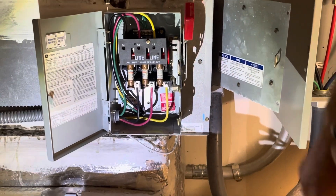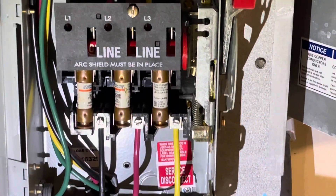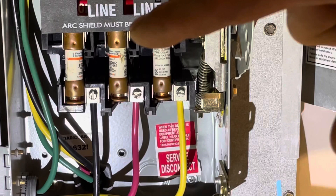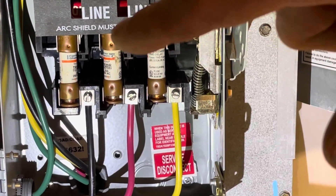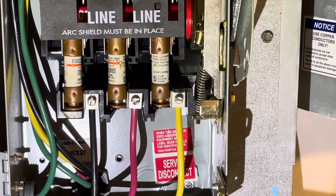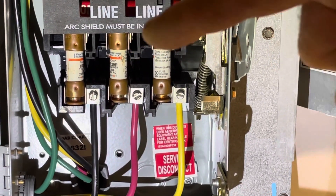Taking a closer look, you can see where that connection is tight on the top, but there's a little tiny gap right there. I believe that's what's causing our dropout. We're going to let it run longer and see if we can duplicate the fault again — we may not be able to — but we know that's a problem, so we're going to fix it.